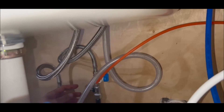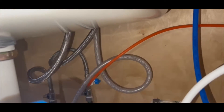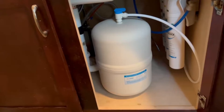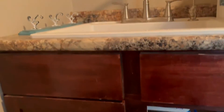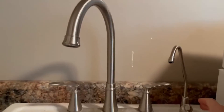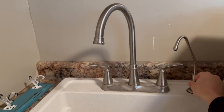You will hear the water running to drain while the unit is operating. Once the water stops running to drain, the tank is full. Open the faucet and allow the tank to drain completely to flush the carbon particles and sanitization solution — do not use this water. Allow the tank to fill completely again and flush for 24 hours before using. Then your water is pure and safe for consumption.